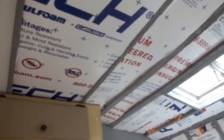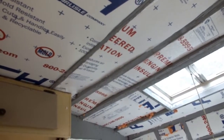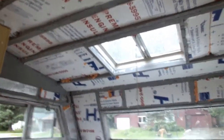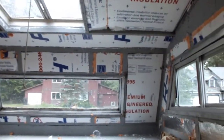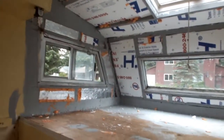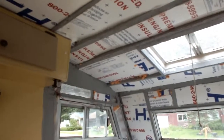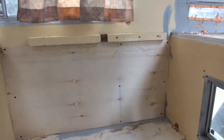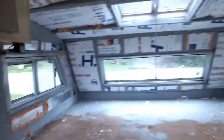Now it has more of a crown and is shedding rain a hell of a lot better. Plus I found a bunch of leaks and pinholes everywhere and patched all those up. Double insulated over the roof where I could. Sealed the outside — some of the leaks were coming from a corner up here. So I sealed the outside and was running the dehumidifier constantly to keep it dry in here while I was patching everything up. Before I got too far on closing up these walls, I thought I'd give you just a little look.